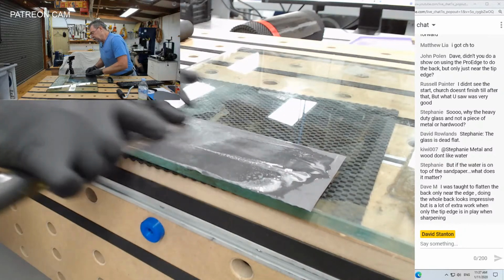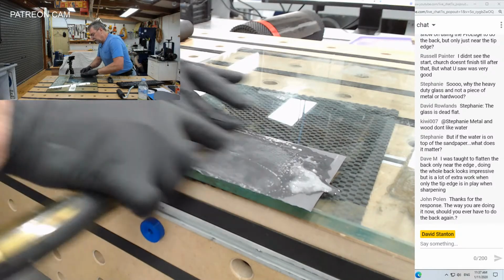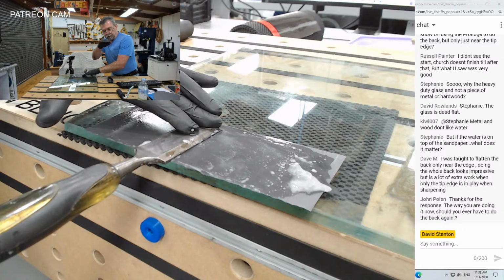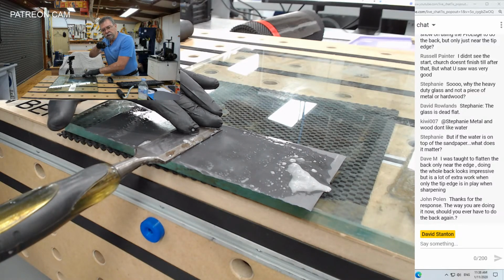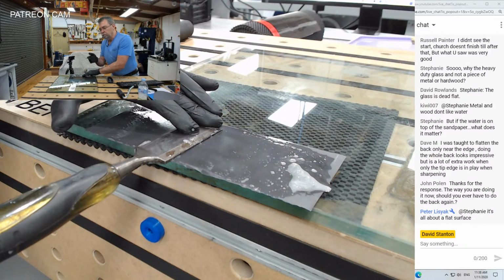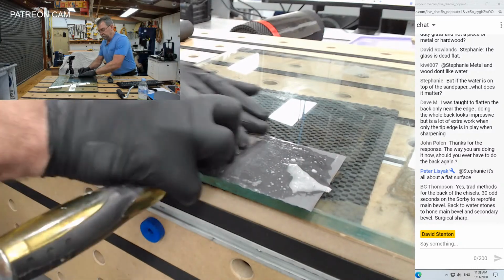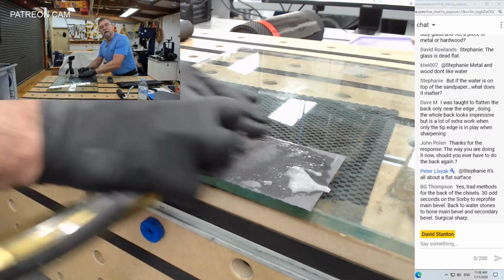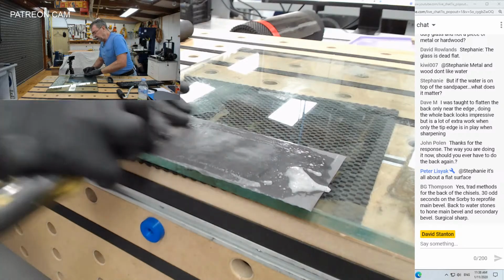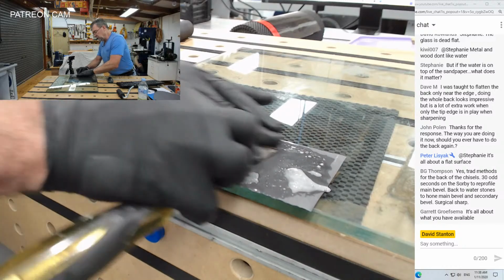If I didn't polish the back up, and it's just a bit slack like sometimes I am, we all are I guess, well, you're going to have little intervals along that cutting edge that aren't going to be sharpened because the back of the chisel might have a little divot or a slot from the abrasive that you've used prior. And if I had only taken it to 120 grit and the top the bevel to 3000, you can see there's going to be little bits along there that are going to miss, and the cut the paper trick at the end isn't going to show as well.